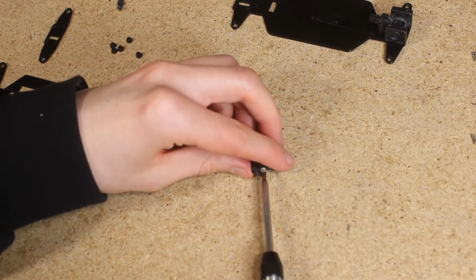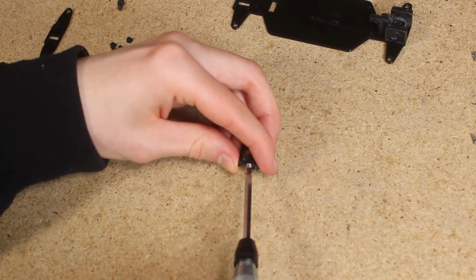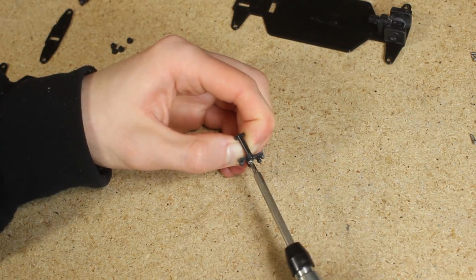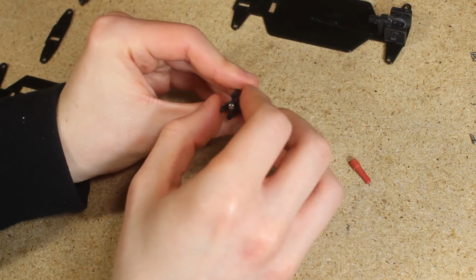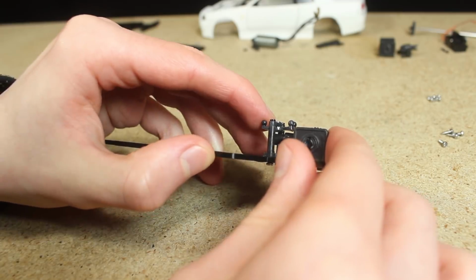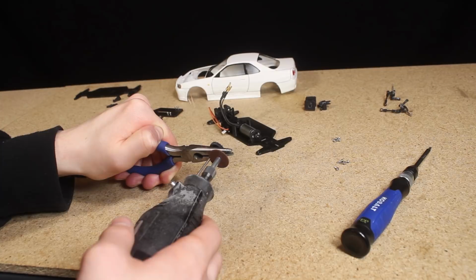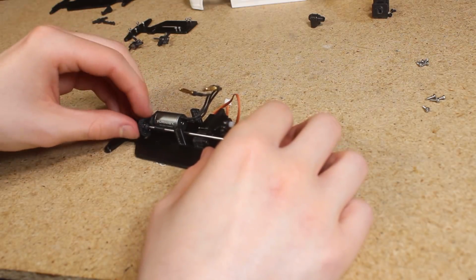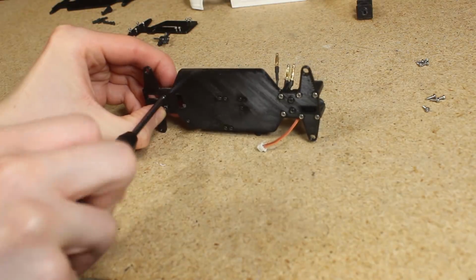As you may recall in the last video, I mentioned that I needed to make some design adjustments to the steering arm since it was colliding with the drive shaft socket. As you can see, the steering arm no longer collides with the moving parts below. One modification that I needed to make was to lengthen the drive shaft since the wheelbase has been increased. I cut the drive shaft into 2 pieces and then added a small spacer that I printed between them.